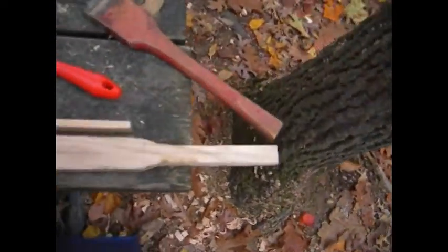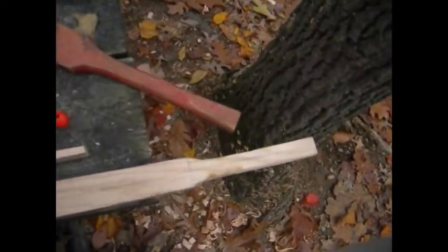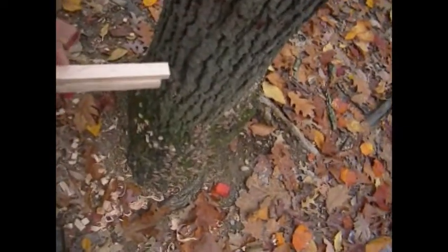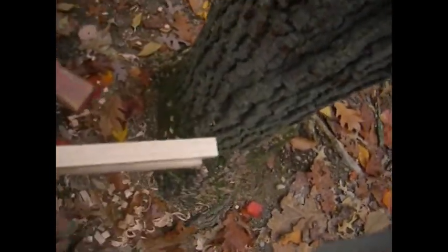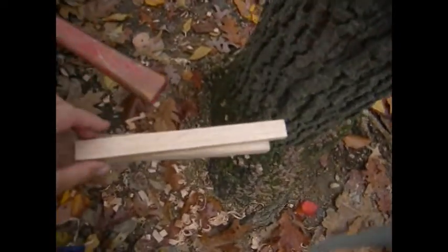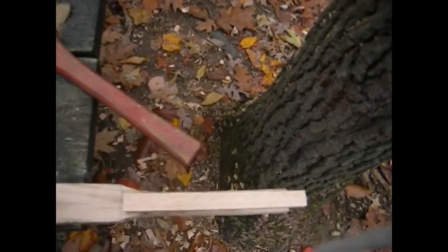Now I have the end fairly shaped — it's rough, but there's a lot of shaping left to do. I'm going to glue the second piece of wood so that the bottom is even with the fade. This piece is a little bit thinner than the actual tip. The tip still has to come in about a sixteenth on each side, but this is going to all be rounded off in the end, and the nock is going to be right up here. So I'm going to go ahead and glue this up, clamp it, and the next video will be after it's unclamped, ready to shape.